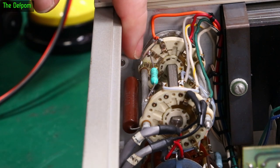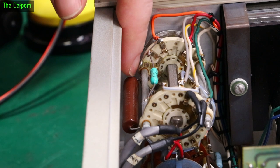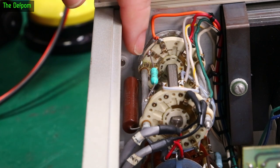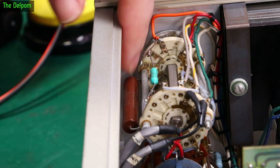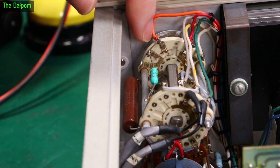So what I've actually got to do is cut right there on that wire right there to separate that resistor from the battery. I need to inject the charging circuitry at that point. So that means then it will be feeding AC in, charging, going to the charging circuitry, coming back, and then going to the battery.